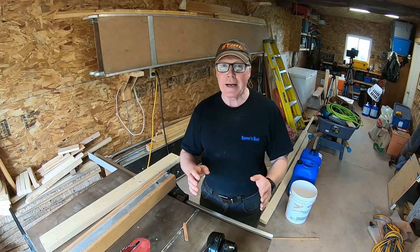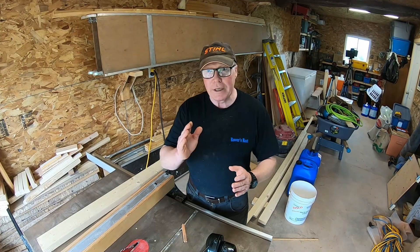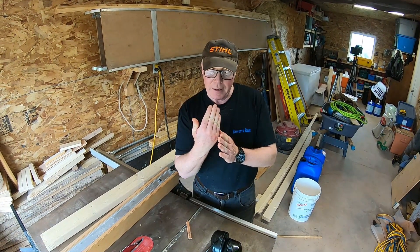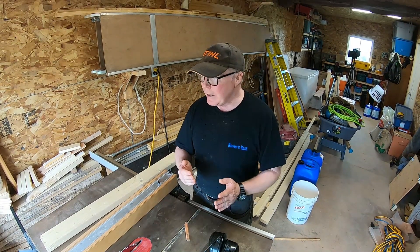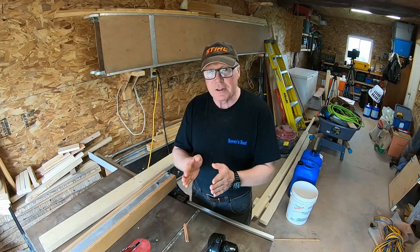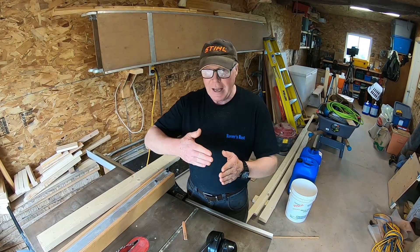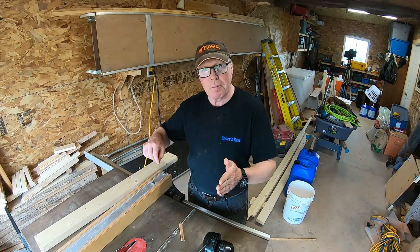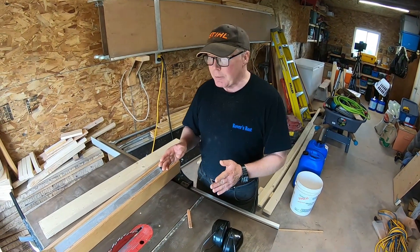They don't have a door to the hen house and that's what I'm working on today. I'm working on the striker — that's the portion where the door enters the jam. A lot of people probably don't recognize this, but that's never perfectly square. In fact, it's usually beveled at five degrees, and that keeps the door from binding on account of the swing from the pin of the hinge. I'm going to cut that on the table saw.